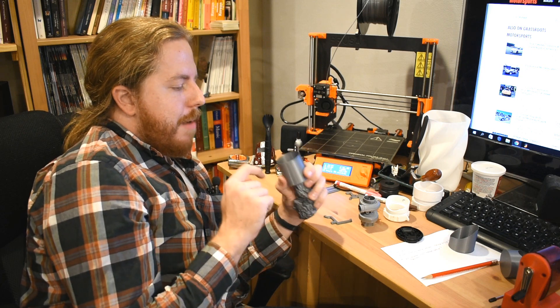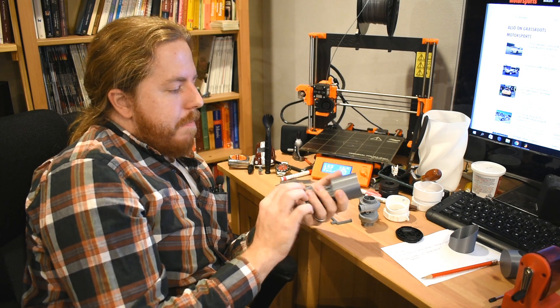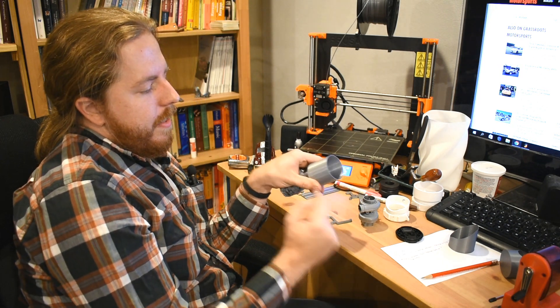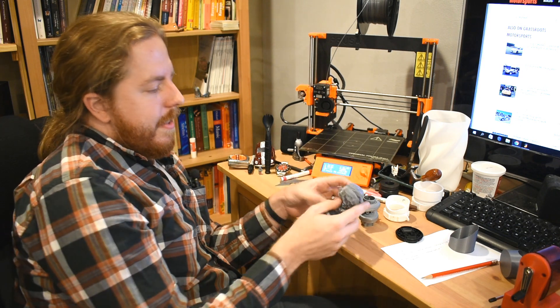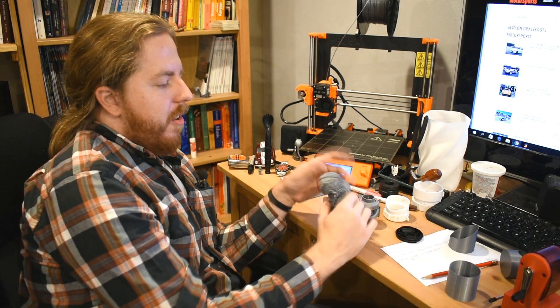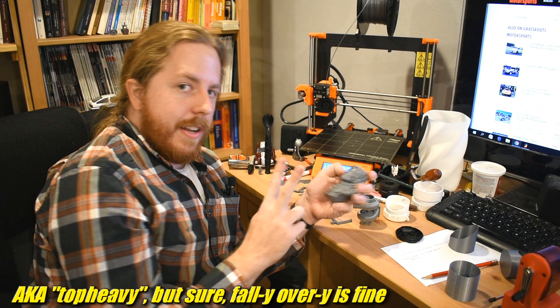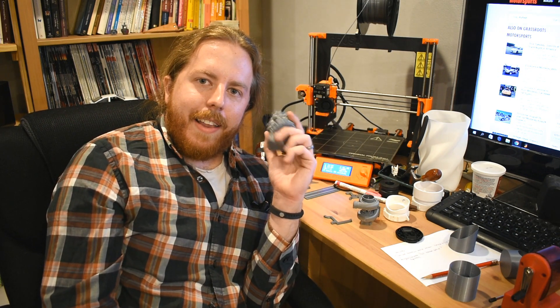Some little bubbles I don't really care about — the bubbles can make it up into this at least before they solidify. And then maybe I'll take the grinder and just chop off like the top few inches of this, and I'll end up with a nice little base to kind of balance them on. He stands there, but I'm afraid if it's aluminum, it's going to be a little more fall-y, over-y. The second thing I need to do — this is not waterproof. I'm going to sink it in Plaster of Paris, which is stuff in water. And if water can get inside, I'm afraid Plaster of Paris will get inside and then solidify inside. And when I do the burnout, the Plaster of Paris will stay in there and screw everything up.